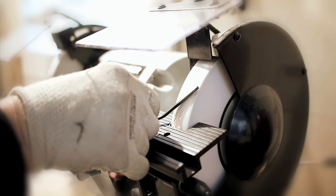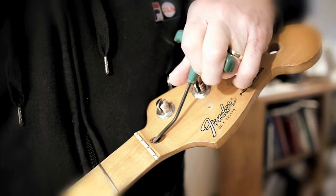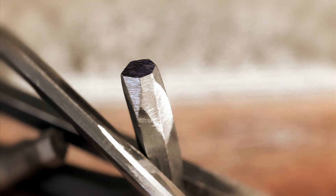Years ago I found a solution to this problem. I ground a tapered tip onto all six sides of a hex wrench. The taper fit into the messed up nut to get a grip. I went through a lot of time and a lot of Allen wrenches before I got it right, but it worked.